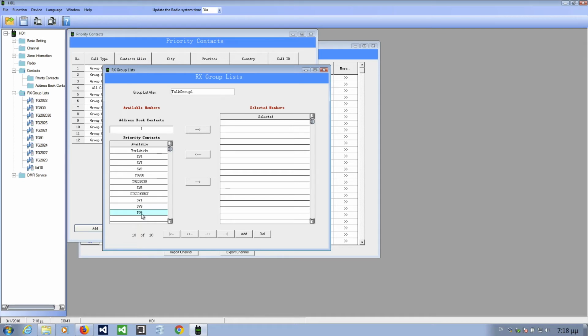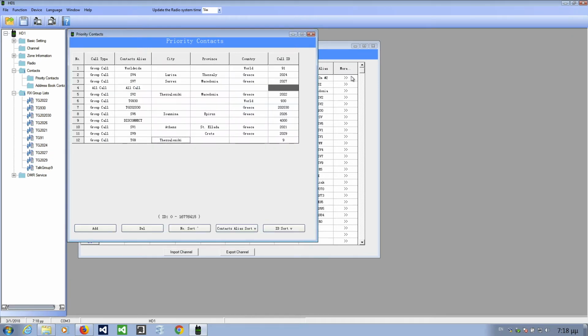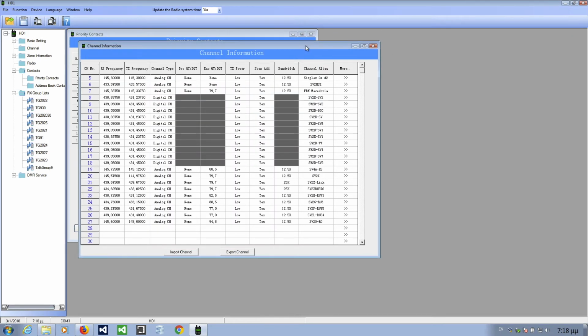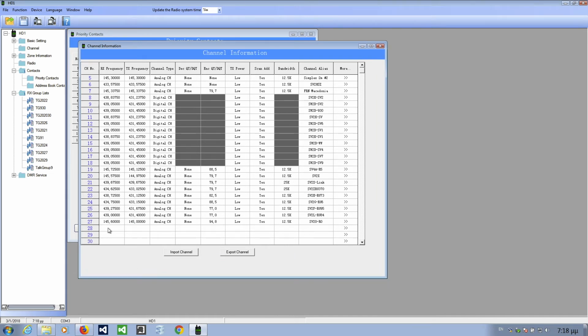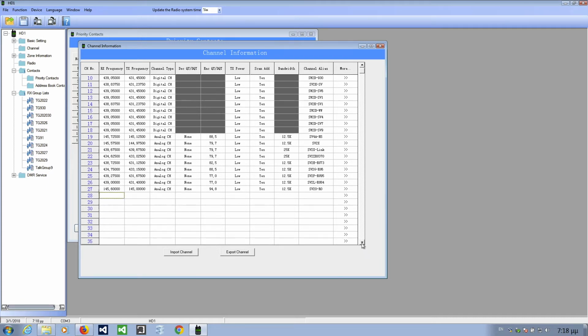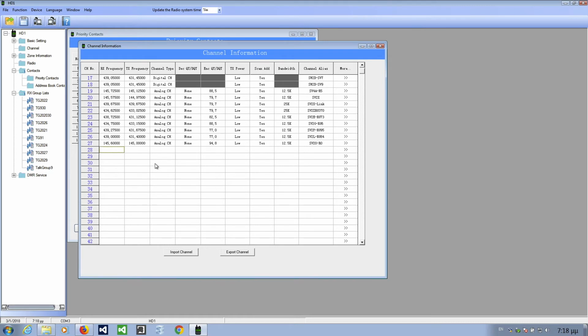Anyway, we select the contact we want and we hit the right button here, priority contacts TG9 in talk group 1. Let's name it talk group 9 so that we know what we're talking about. Okay, and we are ready. Talk group is ready. Let's go over to our channel. Let's add the frequencies. Okay, receive frequency.